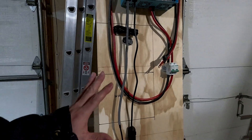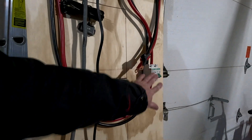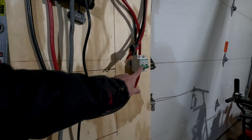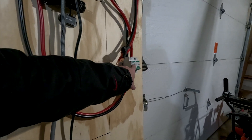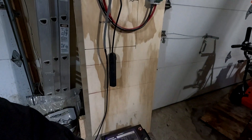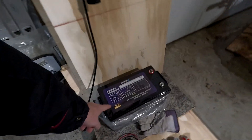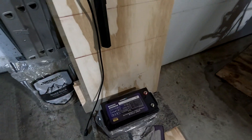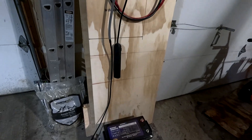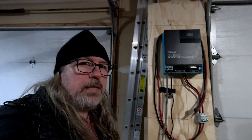I've also been sure to make sure that this breaker is enough to handle the 125 amps that this cable can handle. So if it gets above 125 amps, this will get too warm and flip so I don't end up melting a cable. I don't think you're ever going to get up there — this battery only has 50 amps of power in it, so you're never going to get 125 out of it. But if I add more batteries, then you could.